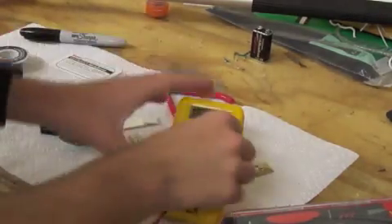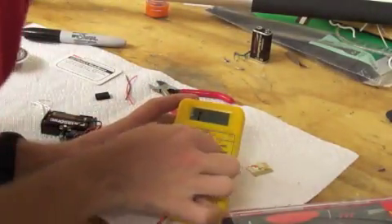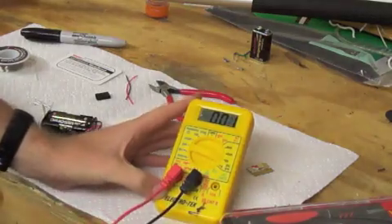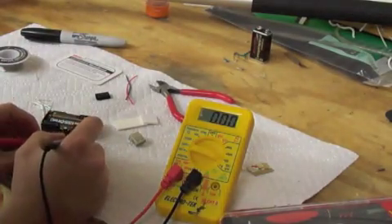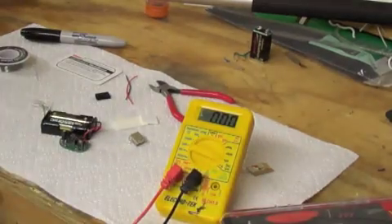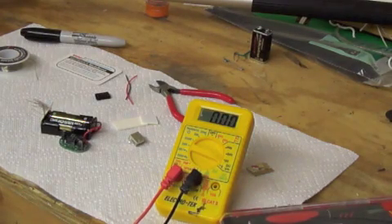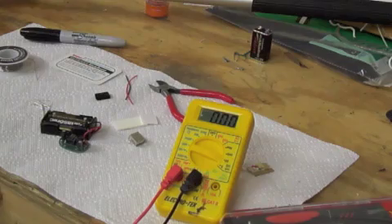Delivering power — 20 volts. Had to make sure what setting I need. It should be about — on the instructions it says 5.08, which is about what it's getting. We're getting 4.95. That could just be resistor differences. It should get a bit higher than 5, but we're not quite there. It's not a big deal — it's not below 3, so we're fine.